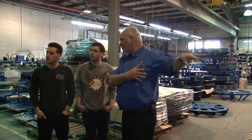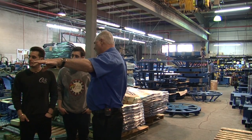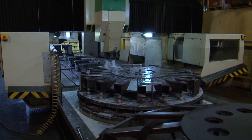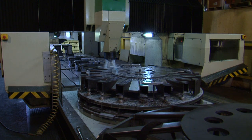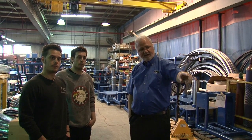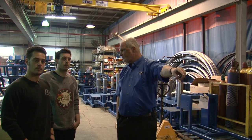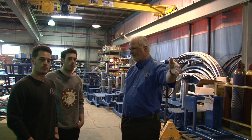This is where the machining center starts. This is a Challenger 3 carousel — it's all machined after welding. This machine is on 12-foot deep concrete pylons because there can be no vibration, as we're basically trying to hold to the fourth decimal point on the tolerances of this product. The carousel will return on one-degree rotations so that no human hand touches the part once it goes into the machine.